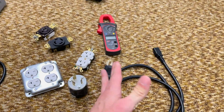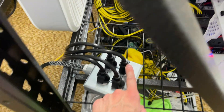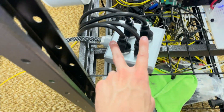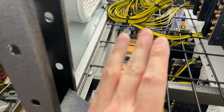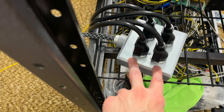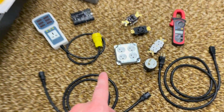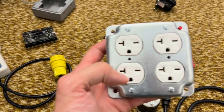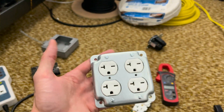The way I'm running mine: I run 750-watt power supplies out of these 20-amp circuits — two per circuit. Each of those is loaded at around three amps or so, because I have them partially loaded in the most efficient range. So each contact in each plug only has to deal with three amps, which is very easy for them. I would be pretty comfortable running these around half of the design load per plug. For these, 10 amps per plug is pretty smooth sailing — if they're good quality. I would try to avoid running more than about 10 amps per plug, but that gives you plenty of power, meaning you could even run a 1,500-watt power supply from one of these, no problem.